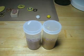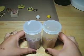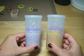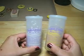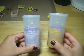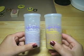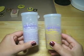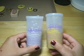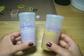Polymer clay demo for Polymer Clay TV is on an amazing product called Amazing Mold Putty. And we talked about this last week. This is a two-part molding material. There's a white part and a yellow part, and this is the 2/3 of a pound kit that I'm holding in my hands. And what we need to do in order to make a mold of almost anything is get an equal piece of white and an equal piece of yellow and blend them together.